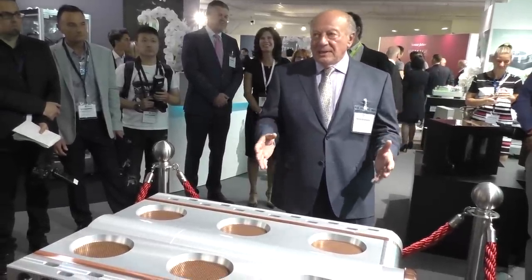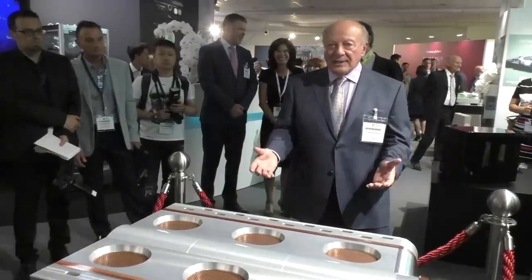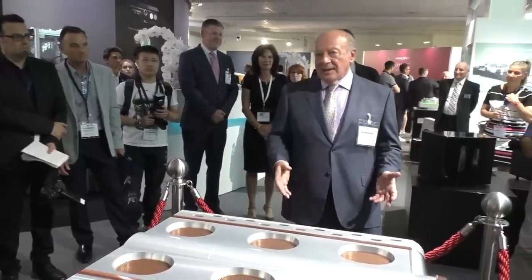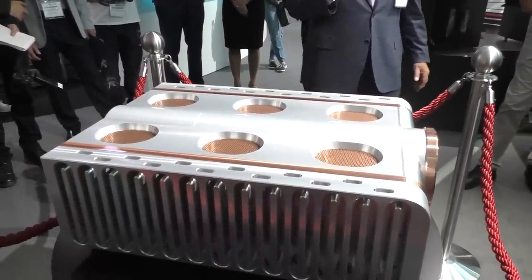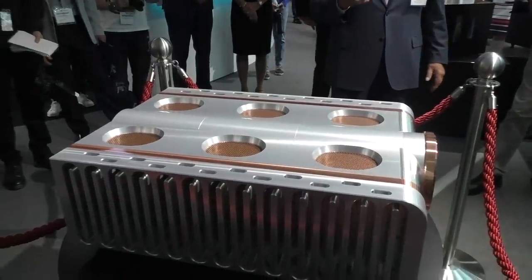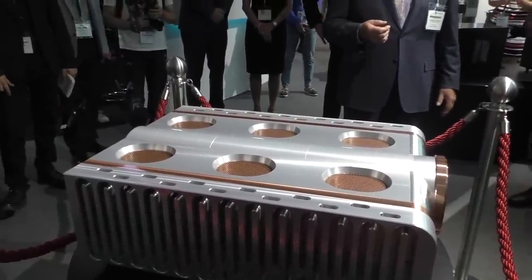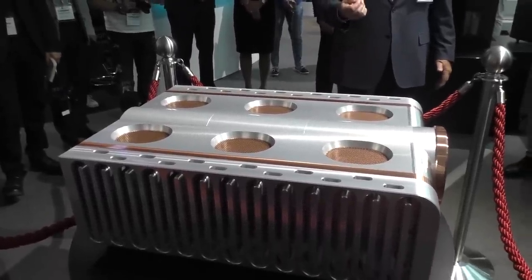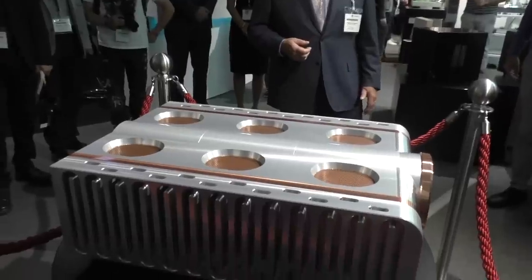So you basically get it on a plinth. You take the cover off, there's lift holes in it, you can pick it up. Four guys can pick it up and set it down, either on a dolly or whatever you want, and wheel it to where it's got to go. It's got 307 hardened stainless steel feet on it that are rounded instead of pointed, because I figure no matter what kind of floor you put it on, it's going to break it if you have a point on it. So I made a rounded foot that it sits on.